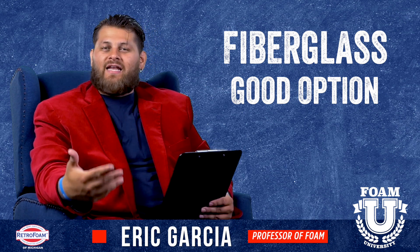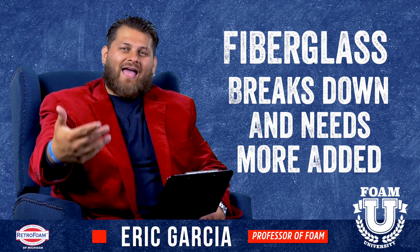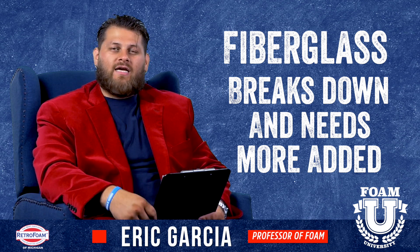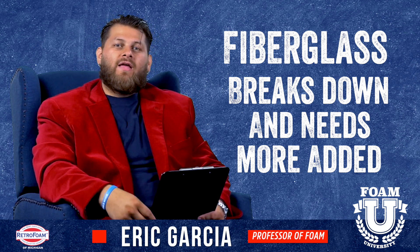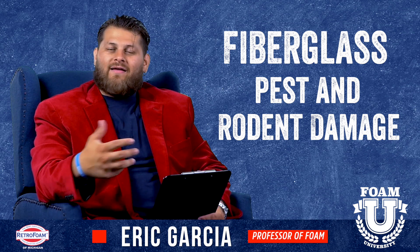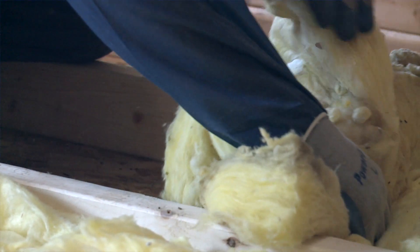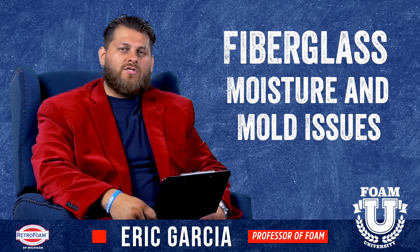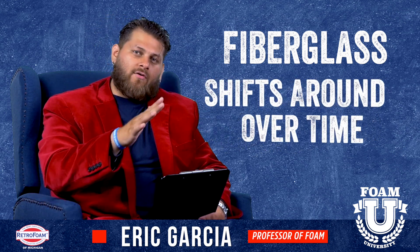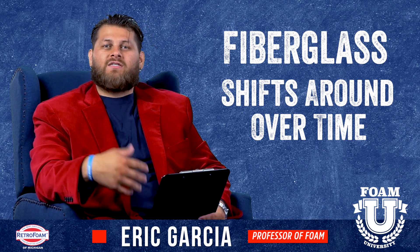Fiberglass, like I said, is good enough. You would typically see a single layer put in, and then over the years a homeowner will usually add layers for several reasons. Over time that fiberglass can start to break down and diminish, so you want to add to it to get it back up in efficiency and effectiveness. Also, if any pests or rodents get inside the attic space, that fiberglass can get torn up easily and retain odors. Potential moisture issues can also cause damage, as can airflow causing that fiberglass to shift and break down. All reasons why you may want to add to or replace it over the years.